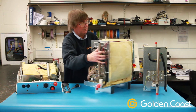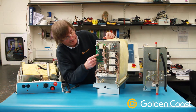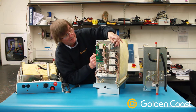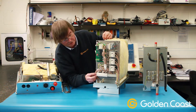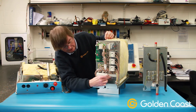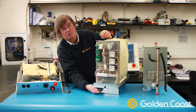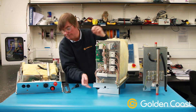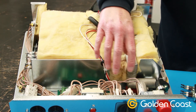At the other end of the steam generator we have the electrical end. Here we have the control PCB, the overheat thermostat — which is a mechanical one with a reset button on the end — the PCB which does all the main control functions, and the inlet terminals along with some other terminals for control and lights. At the very bottom we have a rotary switch, which is meant for isolating the unit for maintenance purposes and not for turning the steam generator on and off. Inside the 246 we have the same equipment just laid out slightly differently.